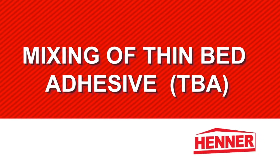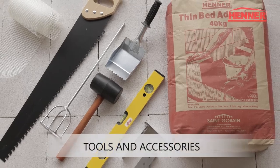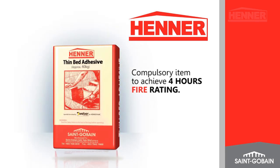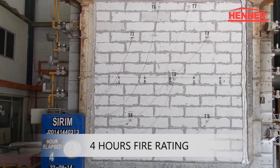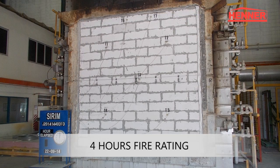Mixing of thin bed adhesive (TBA). HENNER AAC blocks are laid using recommended tools and accessories. HENNER specially formulated thin bed adhesive or TBA comes pre-bagged in 40 kilograms. The TBA achieves up to 4 hours fire rating, has the required bond strength and proven compatibility when used with HENNER AAC blocks as a system.